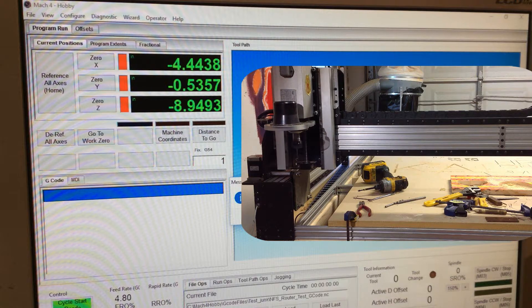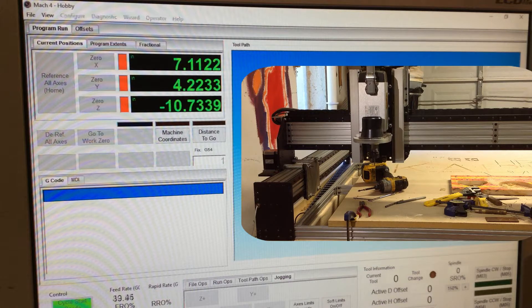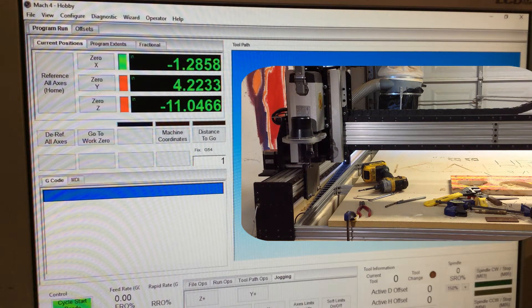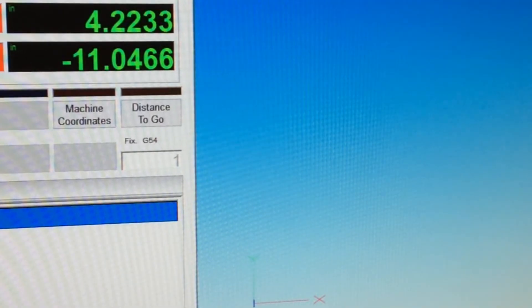X is going the right direction, but Z was wrong. We can see we zeroed everything else out. You've got to check the machine coordinates when you check the home of the machine. With the sensor already activated, it kept trying to drive Z up — Z is going the wrong direction. It has to do with those sensors being active high vs. active low incorrectly set, so basically it runs into the switch and then tries to back off into it some more. X is going the correct direction. I don't know why Y isn't working — sometimes you have to restart Mach after you do a bunch of big changes. So now we've got to change the direction.